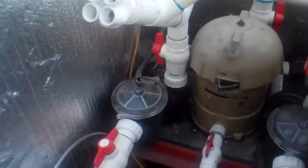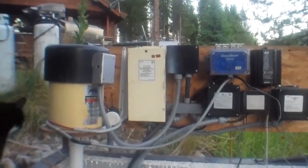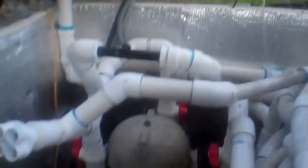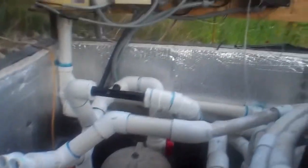These are two-speed pumps. They can run on high and low. They're set up on a timer — it'll cycle itself. It's going to run two hours a day. It's very important that your hot tub runs every day for at least an hour, preferably two. What that does is circulate the water, pulling everything through the system. The UV, the ultraviolet, and the ozone kill the bacteria that forms overnight. So when you get in there, it's nice and fresh and clean. You can't just have one of these sitting at 104 degrees with a lid on it and not expect bad things to grow. So water purification is very important.